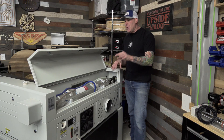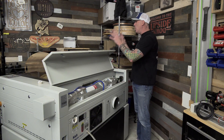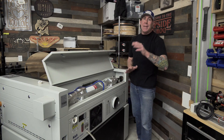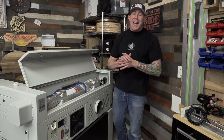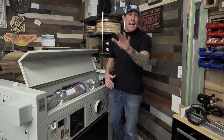That's going to allow this laser tube to produce consistent results. For example, if you have a 90 watt CO2 laser tube and you're struggling to get clean pass-through cuts on your vector cutting, your water chiller might be dirty and it might be time to flush that chiller. When it comes to maintenance, nobody likes doing it, but the manufacturer does recommend you should flush or change your chiller every three to six months.